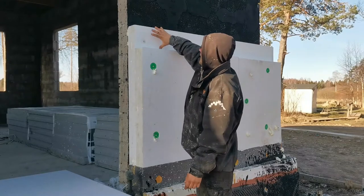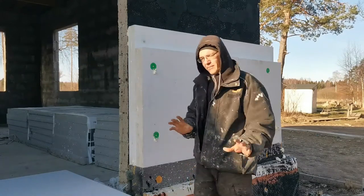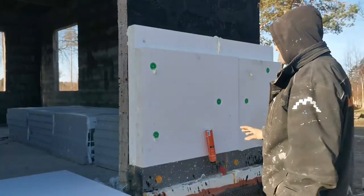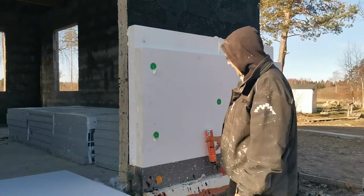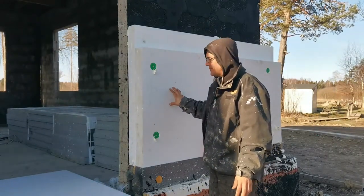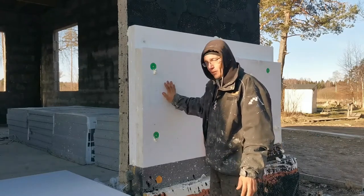Also it's important that the layers are placed in different directions so the heat gets trapped. Everything is foamed in, so there are almost no gaps where air can move. Afterwards, I'm going to do the fourth layer, where I'm going to add this kind of adhesive on top of the joints, so there's no way air can leak in or out. Moisture will penetrate through this because it's EPS foam, and it breathes a really tiny amount, but enough for the walls to breathe. This isn't XPS foam.